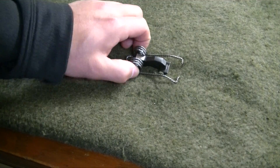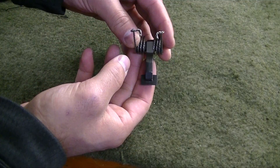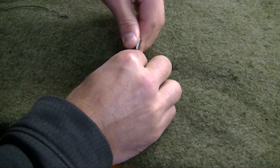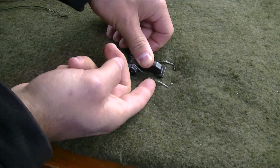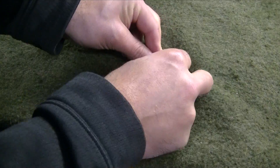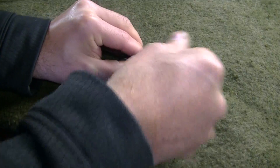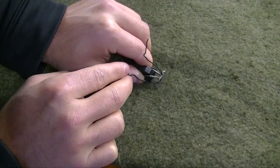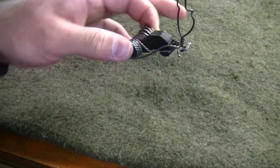I'm going to use the factory mainspring. We're going to take the hammer just like this — the face of it is here, legs are pointed down. We're going to wrap it, push it down, and then take the mainspring legs and wrap them over each other. Probably easier to do on a flat surface, not a rug. They're like this over top, then take your tie strap and get yourself situated. This came loose on me last time, so getting a tight wrap on there.